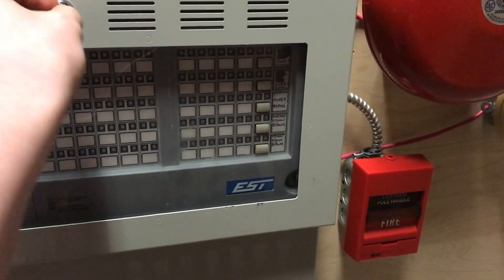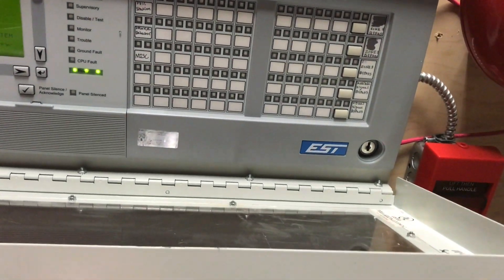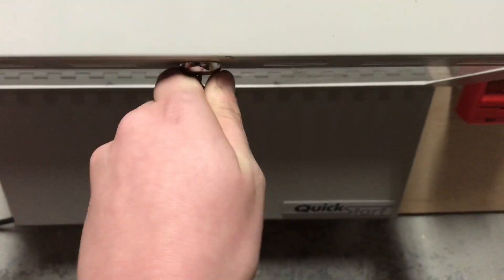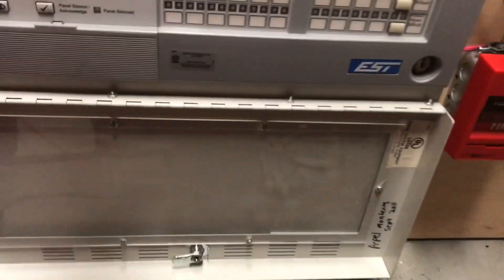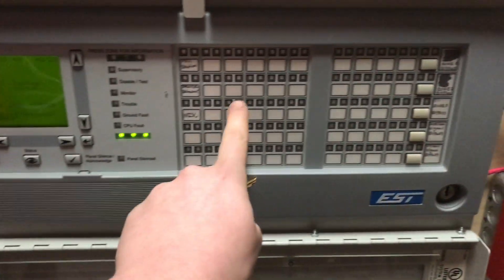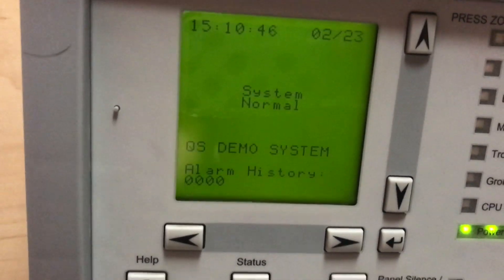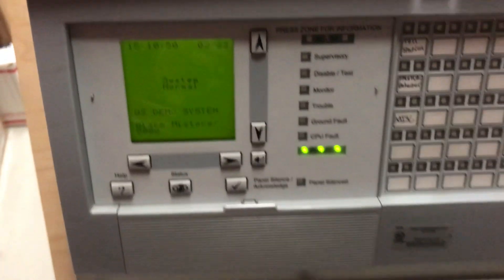First off, this one is actually a Canadian Quick Start, in the sense that it has this little fold-down door kit, which basically gives it this door — it's just a ring that if you take the CPU off, you can just take that whole door off. It also has the LED annunciation modules, which are programmed correctly, and as you can see, it is showing system normal — QS demo system — and I wiped the alarm history.